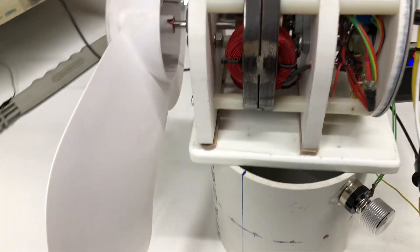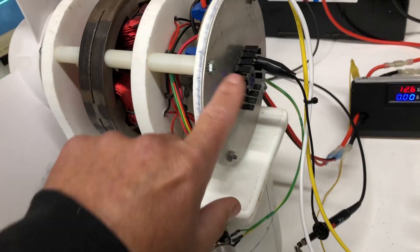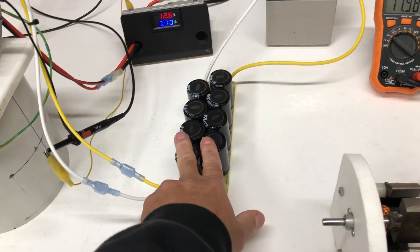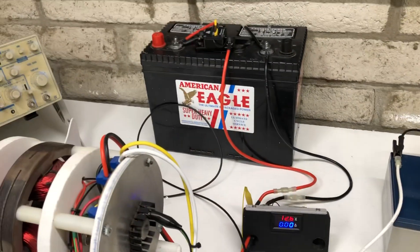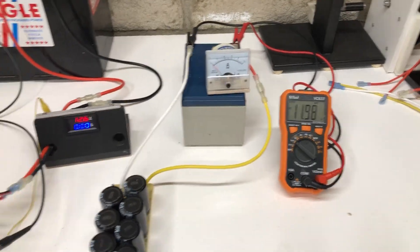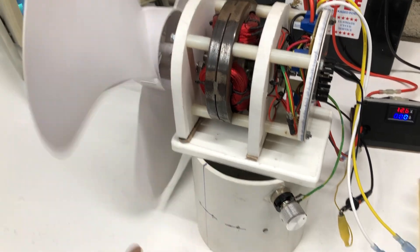This one only has the primary circuit output which comes down right here. On the back we have the MOSFET with a heat sink, and yellow and white wires for output. It goes into a capacitor discharge circuit and then into a second battery. Here's our primary battery sitting at 12.6 volts, our secondary battery at 11.9 volts.